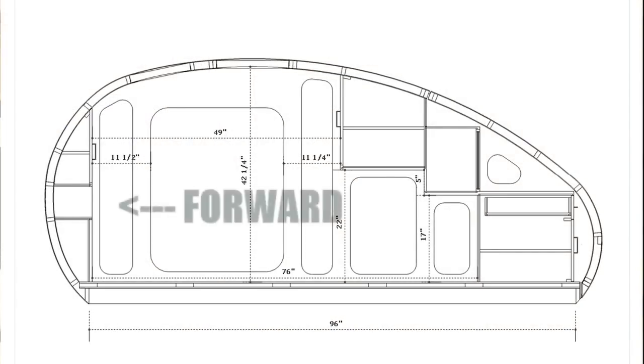And then the third thing I would have done is built it with more weight forward. You see I have kind of the opposite of a teardrop design. When you look at these teardrop trailers, they build them with more of the mass forward, keeping the tongue heavier, more stable on the tow hitch, not wanting to do any kind of wheelie or anything. This trailer wants to kind of wheelie, and when we tow, I put stuff forward. I put the big toolbox in here. And as I build that tongue up and put the utility box on the front and the spare tire, that's all going to be solved. But I wouldn't have had to think about that if I had built with more mass forward.